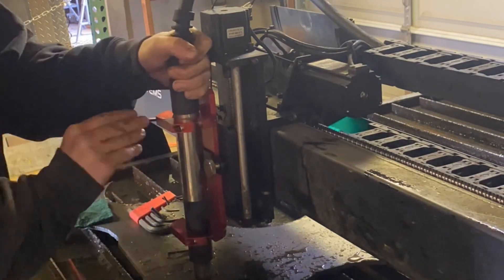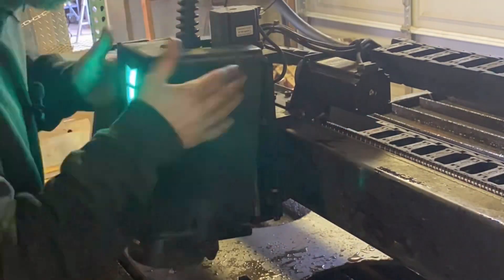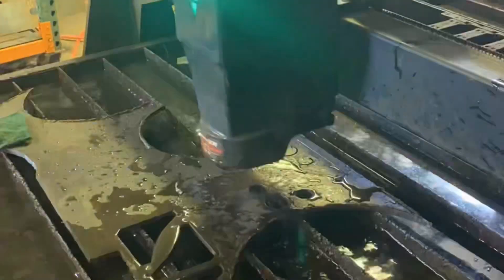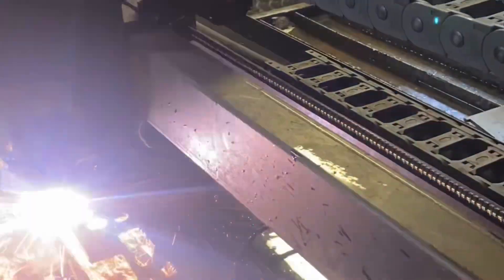What I forgot to show here was that I used some quick-drying WD-40 silicone spray on the screw that the Z-axis travels on. You want to make sure not to use a wet lubricant so that no dust sticks to it and causes any further damage to the machine. Once the machine was reassembled on the Z-axis, I did some test cuts and it all seemed to work out good.